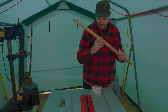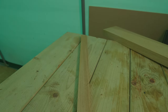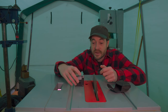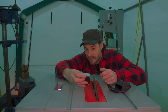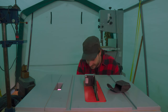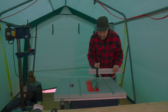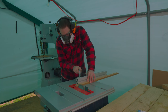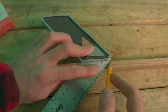So I thought I was going to rip two strips but actually one is going to be big enough to do all four sides, so now I need to cut it to some mitres. I'm going to cut the mitres on the table saw using this little Trend digital level box that just snaps on magnetically, and then I can tilt the blade over to 45 degrees. I'm going to use the mitre gauge to cut the first 45-degree angle. With that done I can use the cards to mark out where the next one needs to go and keep cutting all four sides.